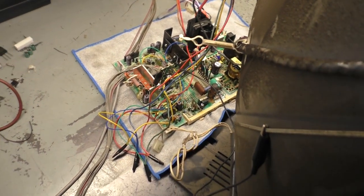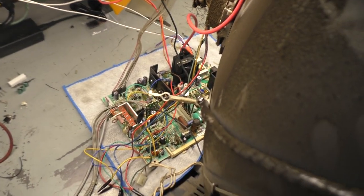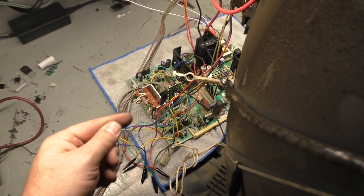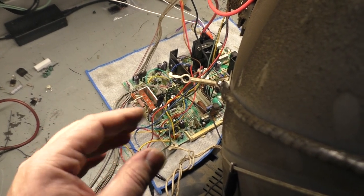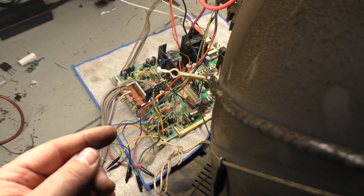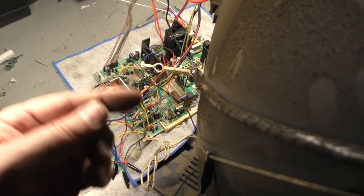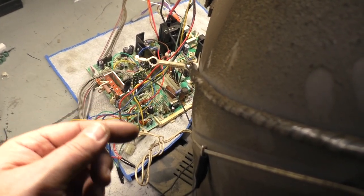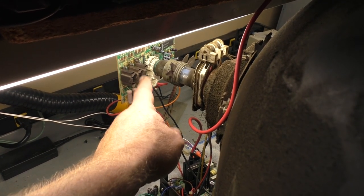Okay, I have spent the last about 2.5 hours just smashing my head against the wall because I kept getting one cascading failure after another. We saw this was operational and fine, except we kept losing colors. We had all blue because I think the transistor was shorted, and then we lost blue, and then we lost green. Green came back and then lost green again, and I had already changed the blue transistor, which fixed our blue problem, but it turned out the green transistor was also bad.